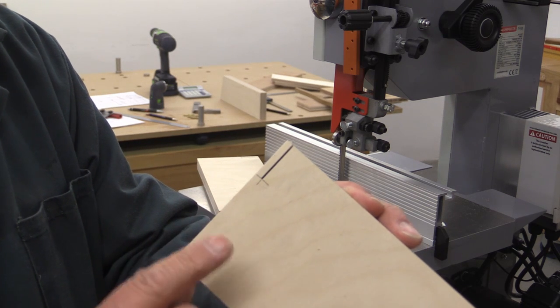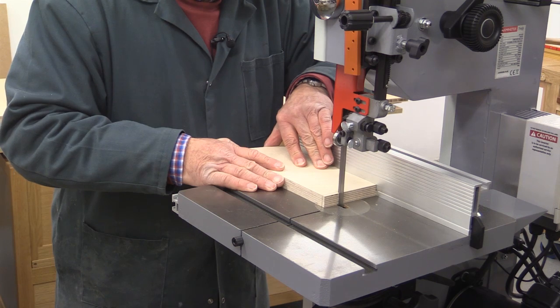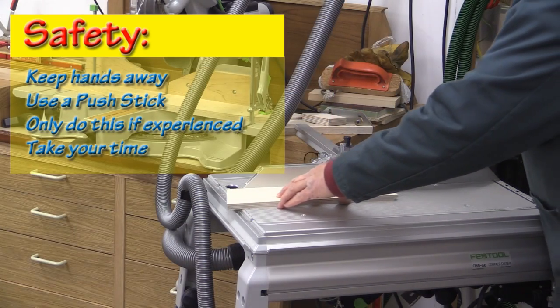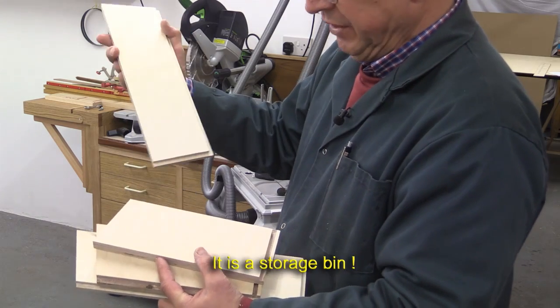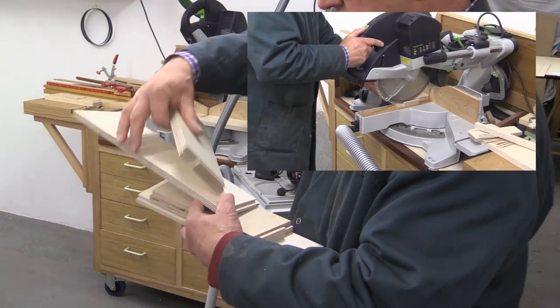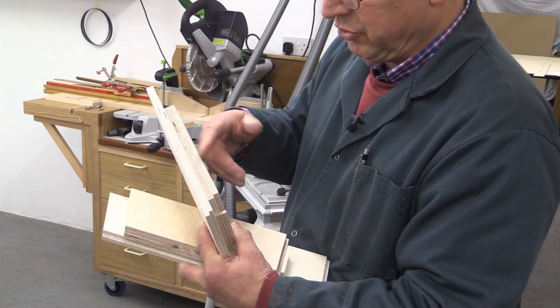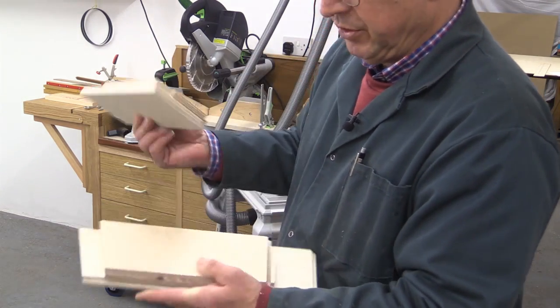I was following that line — I'd set the fence to 5mm — absolutely perfect. I've just done the finished part of that rebate for the side piece for the pull-flat drawer things. I did the same technique for the upper one as well. The bottom rebates were done using the Carvex saw. The wood I had for these pieces is different — I'm just using up workshop scrap. This is a piece of 18mm and this is a piece of 15mm ply, just using up odds and ends.